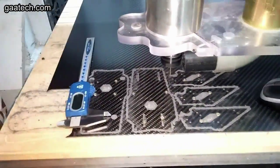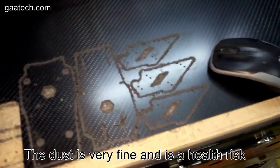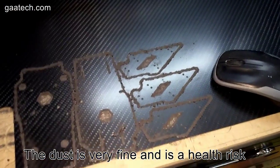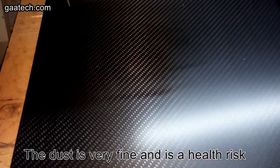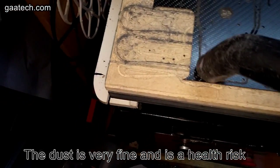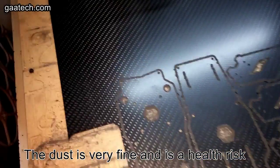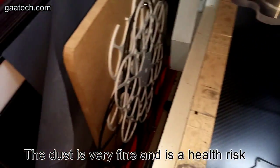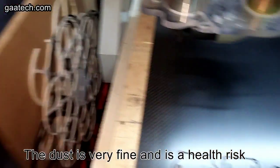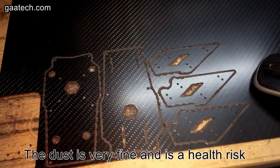I hope you find this video interesting — you've got about three minutes left. At the end I do struggle picking the parts up one-handed because I was using my phone to record; I wasn't really set up to do a video. Here I'm just getting up the dust, and the dust is a health risk. It is a very, very fine carbon — like graphite out of a pencil. It does get in your pores and into your skin, so don't breathe it in — it will do you harm.